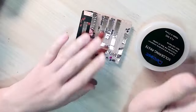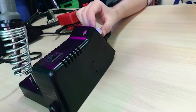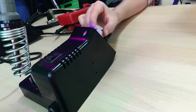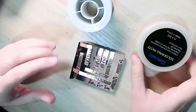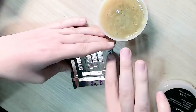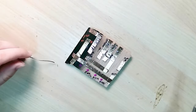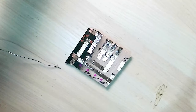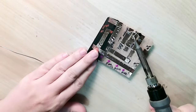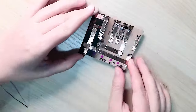Now it's time to solder. You'll need flux, 60-40 solder, and tweezers. I heat my soldering iron to about 700 degrees Fahrenheit so the solder flows well — at that temperature, be quick so you don't burn or oxidize the copper tape and disturb the adhesive on its underside. Applying flux to the copper tape will help the solder stick more quickly. I started by prepping soldering points for the MPF-102 transistor: apply a small bead of solder to the points on the board, then apply flux and a bit of solder to the transistor's leads, line up the right leads with the right lanes, and bring the iron down on the points until the transistor is in place.